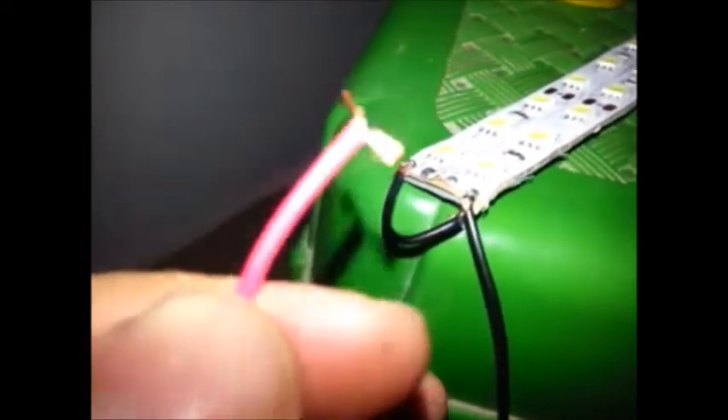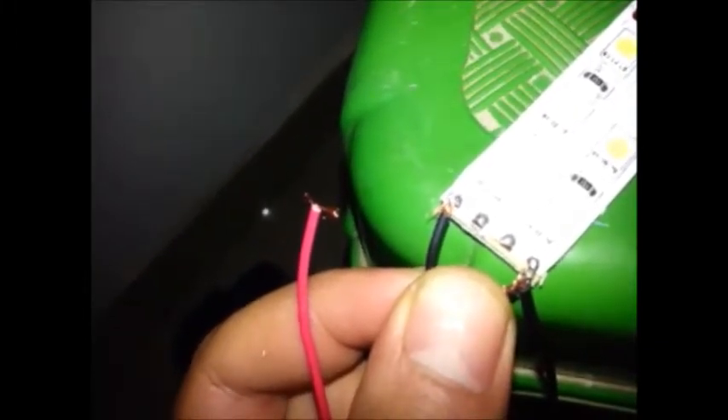I am not sure you can see this clearly but what I am trying to do here is have these strips kind of soldered together. I don't have good lighting here so I am just showing you — if you notice there is a parallel connection which I am doing with the negative and here is the positive wire. So I am just going to solder them together here. The middle section here is just plus 12 volt and the sides are actually the negative terminals. So I am just going to solder them together and connect both the strips together.